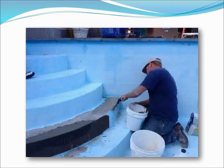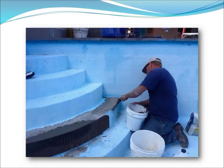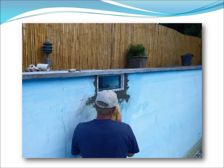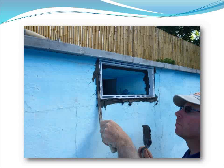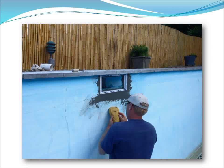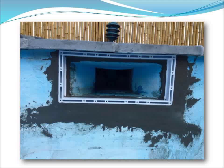The first thing that had to be done was to make the pool ready for the Pool Hide installation. Todd, the mason, repaired the steps that Riley had smashed with the sledgehammer, and he installed a standard vinyl liner skimmer housing receiver so that when the Pool Hide would be installed, it could be gasketed and sealed with a faceplate screwed into the housing. Todd simply cut out a section of the concrete wall and mortared the receiver part of the skimmer housing into the pool wall.